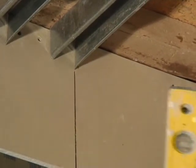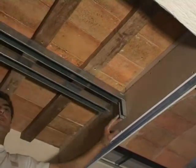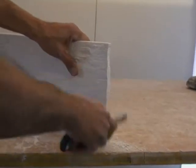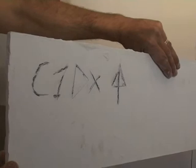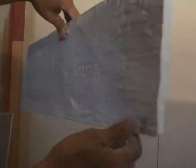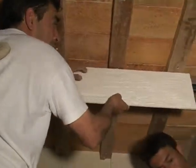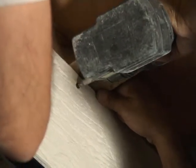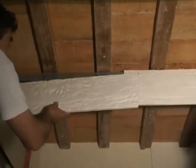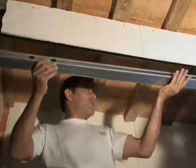Trim the side of the beam accordingly to fit to the wall seamlessly. Take one side of beam and trim the top part to fit the wall. The initial C1DX means that this beam is called C and will be the first to be installed on the right. Screw in the side of the beam directly to the structure. Proceed in the same manner with beam C2DX, making sure the edges are aligned correctly to the side and clean any excess.